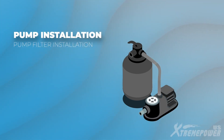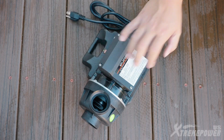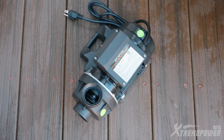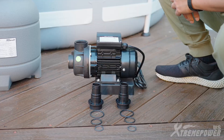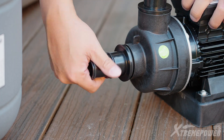Let's install the pump. Place the pump on top of the base, aligning it with all four screw holes. Place the washers with the screws and then insert the screw into the hole. Use a Phillips driver to securely tighten the screws. Put o-rings on the pump's hose adapters. Screw all the hose adapters onto the pump.